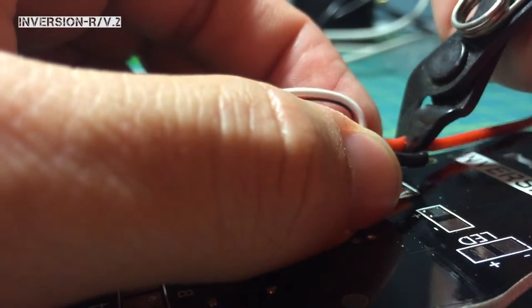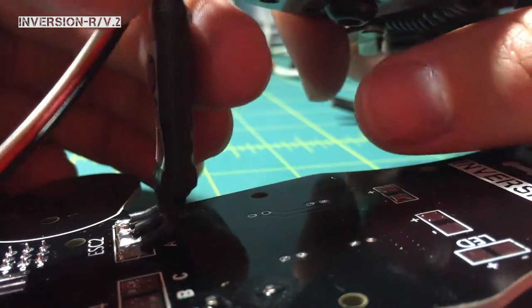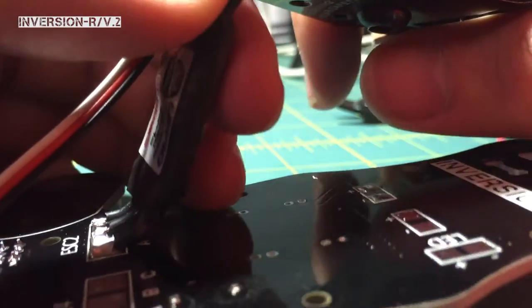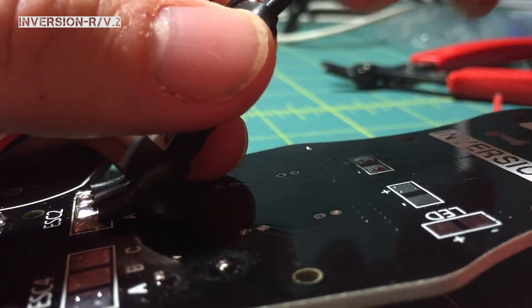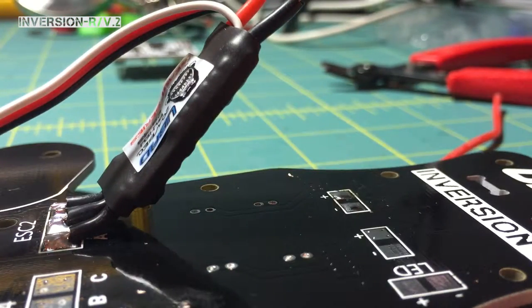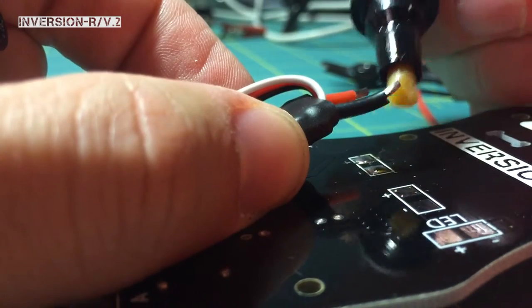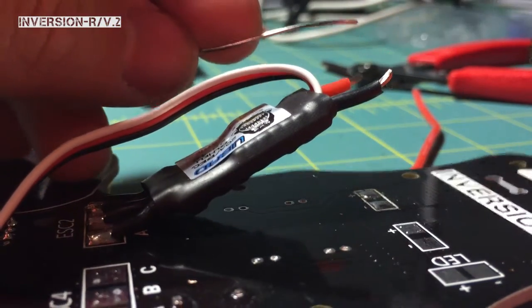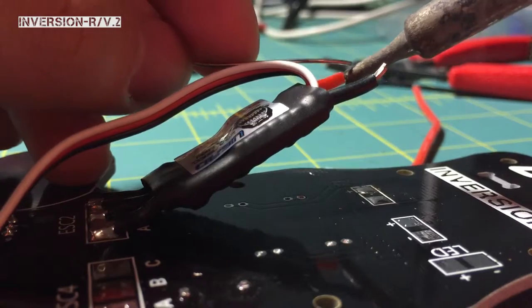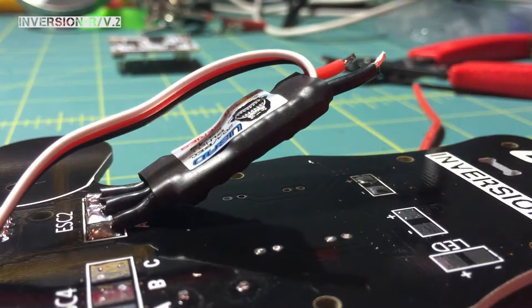So let me do that real quick — I'll cut it down, probably about to right here. I could take some measurements of these wires and give you a set length so you know you're safe. We'll bend it over there and give ourselves a little extra play. Got your little nubs — I've got some nice little clippers here to strip it down. Let me flux these wires. This makes it a little easier for them to take that solder. Give it a little tin, come from this angle here and tin it. This will make it so much easier for you.